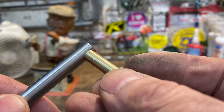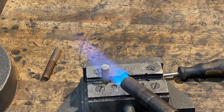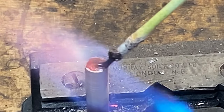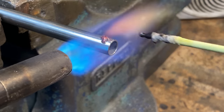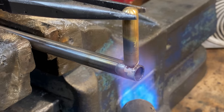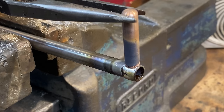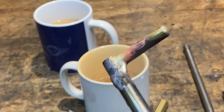I'm now going to silver solder a short stubby piece of brass onto the end of the tube to act as a handle — this piece was already machined from a previous job. I first put some silver solder on one end of the brass piece, then silver solder the tube end, and warm them both up together to join them. This is because I've only got two hands and we really need three to do this job. I offer up the brass piece to the stainless steel tube, holding it in place with pliers, while I gently warm it with the blowtorch until it melts together. I know when it's safe to let go because you can see the crystals form on the surface of the braze. I then quench it in my quenching water — not my tea — and give it a good clean and polish with some abrasive cloth until it's all shiny.